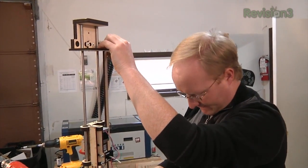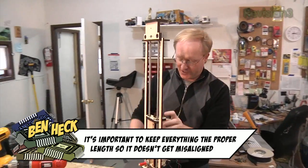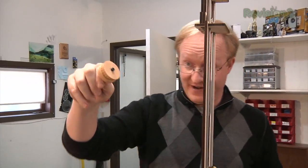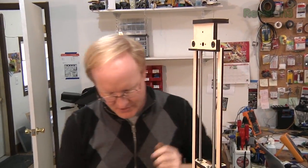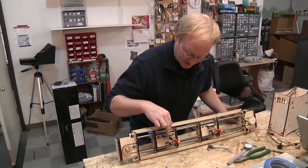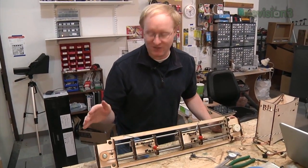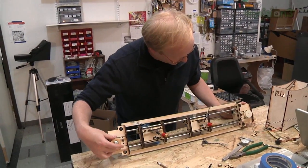Here's a length spacer — a little short. We want to make sure these two rods are cut to the same length. If they're not, they can be a little crooked and this will not slide very well. It looks like it's moving pretty good. Here's the other 3D printed pulley — this one is just an idler pulley, it just spins. I'm going to put a washer in there. Here's the belt we attached. We had several problems: one, these extruders were designed before the Y-carriage, so they weren't in quite the right spot. Two, we had to make sure it was really tight. We solved that by having some teeth marks in the clamp, so the teeth of the belt clamp right into it. The next problem was with our pulley — we used a printed pulley first that had teeth on it, but that didn't quite work. So I've replaced it with a skate bearing and a metric bolt going through it, and then I just custom printed the pulley. So now we have it working pretty good and we can test it.